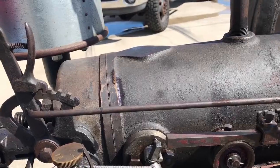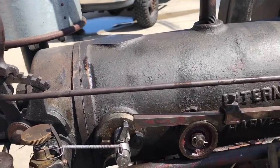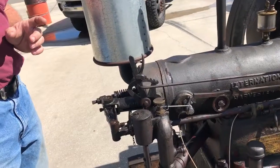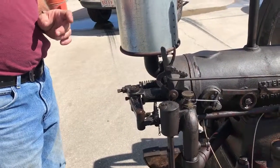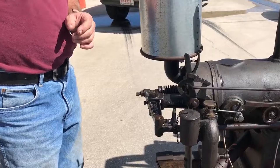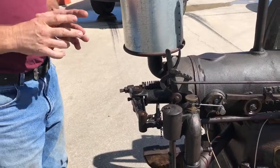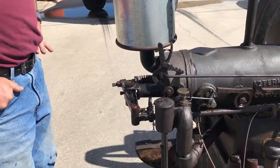So is it basically a capacitor or something? Well, I'm using a transformer, and just the coils of that transformer, the windings. Okay. So when those points close, that's where your energy is storing up. Right. And as soon as they snap open, that field drops, and that's where the energy goes. That's pretty neat.